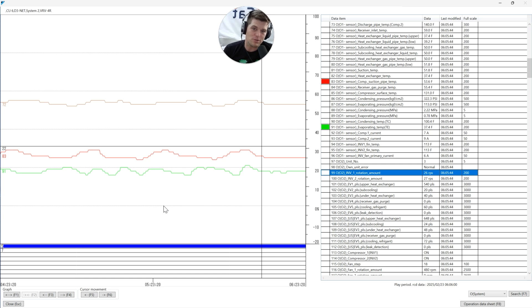At the end of the day, we found what killed this compressor, made the changes that needed to take place, and then viewed the operational data to find a positive impact from the changes we made. You find a dead compressor, look at the data, fix the problem killing the compressor, and verify your changes are all the changes needed to reach the end solution. This system is going to live a long happy life - we're filtering it right now to get all contaminants out. That's accumulators on VRV equipment and what to look for when troubleshooting live field data.